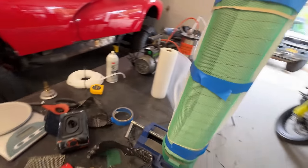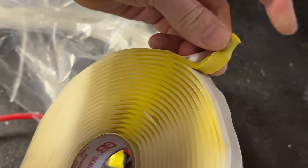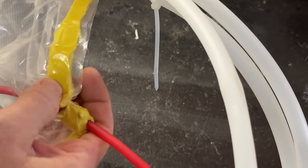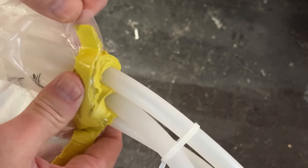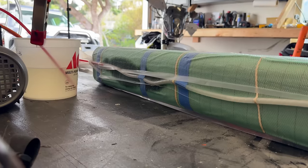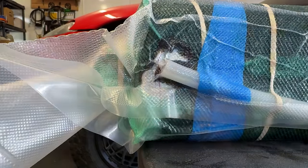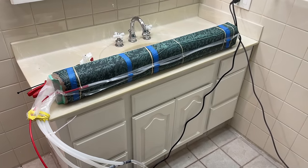Since we were using those food bags, we only needed to seal up one side. We couldn't use the heat strip because of the tubes, so we used a squishy double-sided tape — not actually double-sided tape, more like a real sticky clay. You mash it in and knead it around to make sure there are no openings for air. There are always openings for air, so just squish it a whole bunch. With that done, it was time to suck — and suck we did. The resin slowly moved up the spiral wrap, wetting out the peel ply and the carbon. You can see all the little bubbles moving through the resin, probably because we didn't degas it properly. But the resin flowed toward the vacuum hoses, slowly soaking into all the carbon. After it was all soaked, we moved it to the composites oven — this time a bathroom instead of the closet, so we don't accidentally burn the house down.